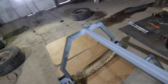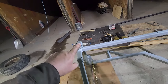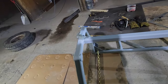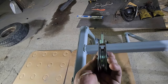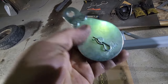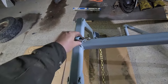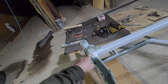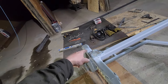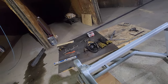I did forget — after I got it all primed up — I have to fasten a pulley onto there so the winch cable will go around the pulley and down. So I got to weld this. I'm probably going to make new side plates for this — I basically just bought it for the inside pulley. This is really thin, this is only like 550 pound rated. So I'll just take the pulley out of there and I'll make thicker brackets, and I'll leave it so I can remove the pin. And then I'll probably put a cage over it so the cable can't just flip off if you hit a bump or something.